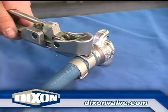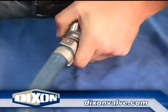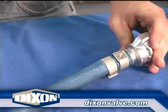Make sure the clamp buckles are offset to prevent a leak path. Repeat the process of tensioning, lock setting, and breaking off the tail. For ⅝ inch assemblies, place the clamps just inside each mark for proper installation.